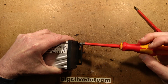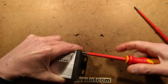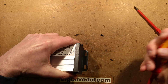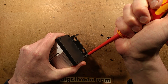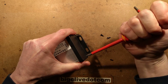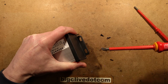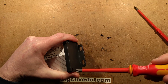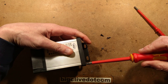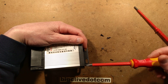It's the usual construction — the plastic end cap goes into the end of an extrusion. I haven't tested the power rating, but there are a couple of things to be aware of when buying power supplies from China. One is that their electrical standards aren't quite up to the same standard as ours, so the isolation between the mains side and the low voltage side may not be what you want — it carries the risk of things going live. The other thing is they tend to over-exaggerate their ratings. This one is supposedly 100 watt rated; I'd probably only use it at about half that.